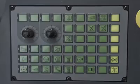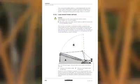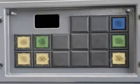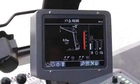For assembly of the crane, activate the assembly self-lock function on the X23 control panel in order to be able to work outside of the valid load chart. Furthermore, assembly functions must be pre-selected so that all assembly functions and cylinders can be used. The assembly mode wrench symbol on the monitor indicates the relevant mode.